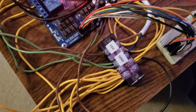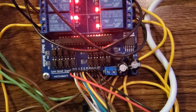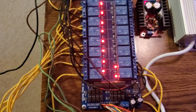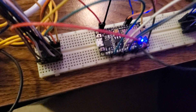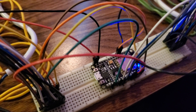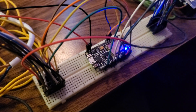In addition, coming out of 12 volts I have 12 volts going into this relay board right here. The 12 volts actually goes into the terminal on the bottom there. The 12 volts is needed to trigger these relays, and these particular relay boards also have a little power supply that will output 5 volts, which is perfect because 5 volts is needed to power the ESP8266 microcontroller right there. You can get a pair of these for about $10 on Amazon — they're dirt cheap and excellent for programming projects such as this.